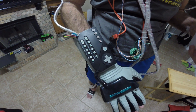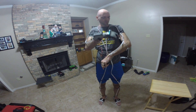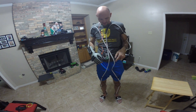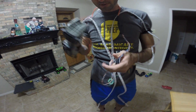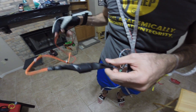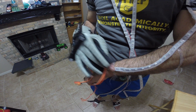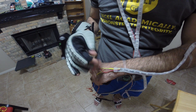After we've done that, it's technically hooked into the suit. It kind of goes up the legs, comes up the middle, splits, and loops around — it's just a bunch of elastic that's knotted around. I like the elastic because it's flexible, moves with your body, and you can readjust it at any point. All the wiring connecting the two bottom pieces together is done with braided Cat5. I've got the power cables looped around my neck temporarily. In here there's a capacitor — I can't remember the specs off the top of my head — and I've got a heat shrink tube to keep it sealed up. These lights are waterproof and individually addressable. You can get these from Adafruit or SparkFun — Adafruit was out at the time, so I picked mine up from SparkFun.